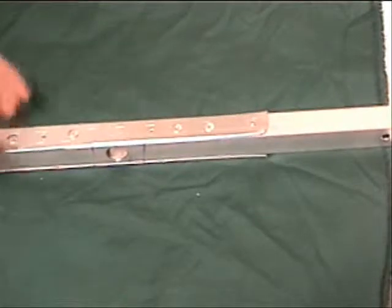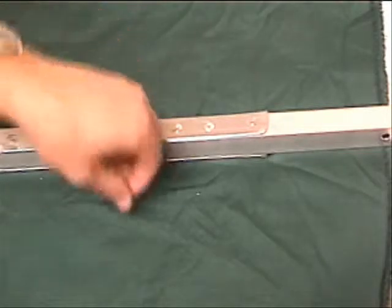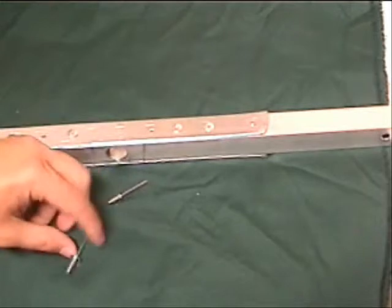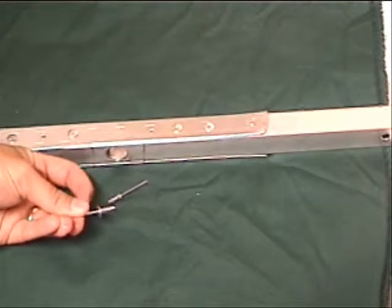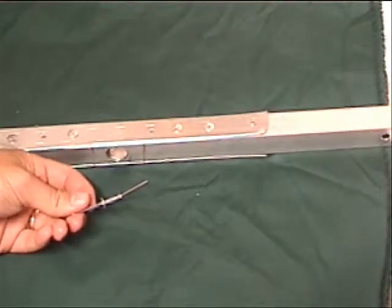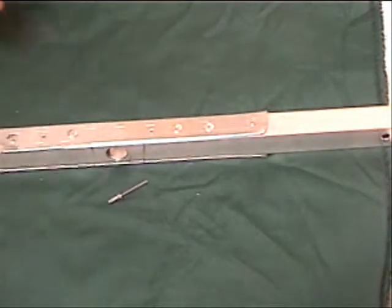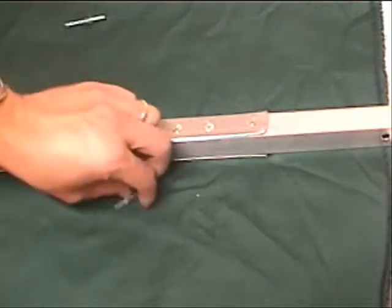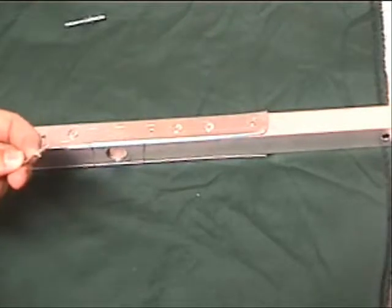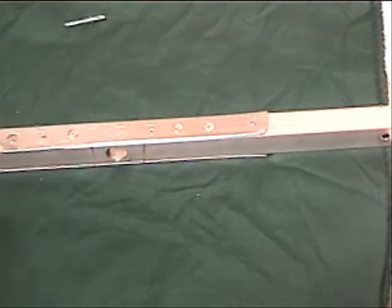Another thing you want to keep in mind is what size rivet to grab. We generally use a lot of 1/8-inch rivets, which are these small ones here. We have the larger flanges for dealing with soft material like treads on wheels, if you need to put it in polycarbonate, things like that. So you put that on the softer material side. And then for metal, we'll tend to use these smaller ones just because they fit in easier. You can get more of them in and make this joint stronger. Generally speaking, the more rivets you have in the joint, the stronger it's going to be.